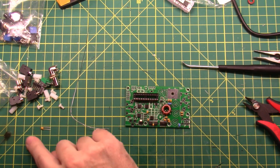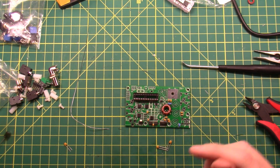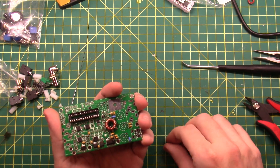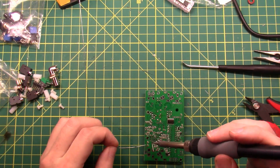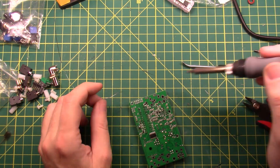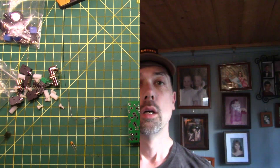I need some 105s and I have three of them — good. They go in C21 and C22. The writing goes down and left. There are some small components nearby so I take care not to desolder them. Because I was being extra careful, I check my work extra hard and that all looks good. We got a whole bunch of parts installed and we are making some progress. Be sure to stay subscribed to the channel for future videos in the series. Stick around for channel supporters, a list of members and patrons coming up next — thanks for being awesome.